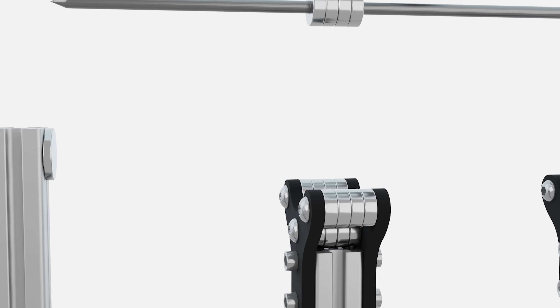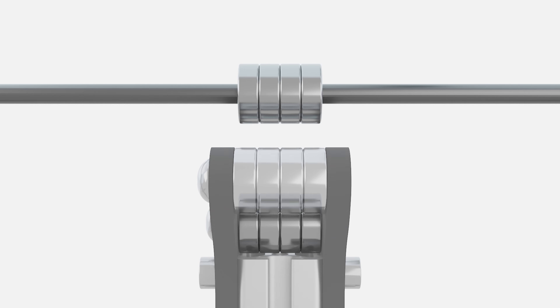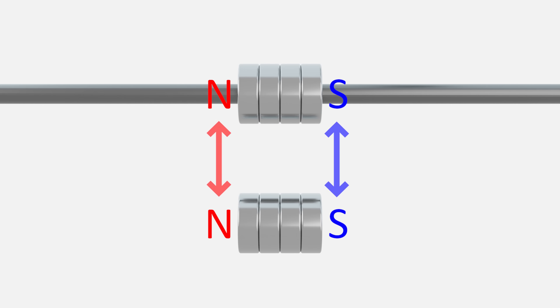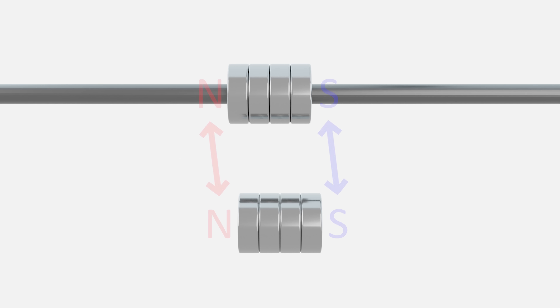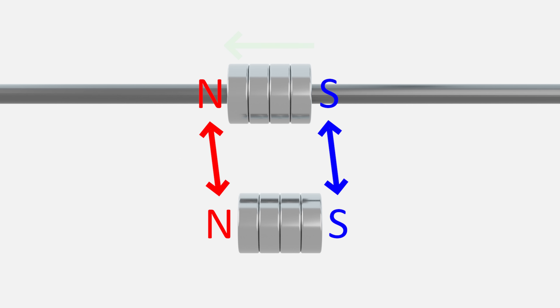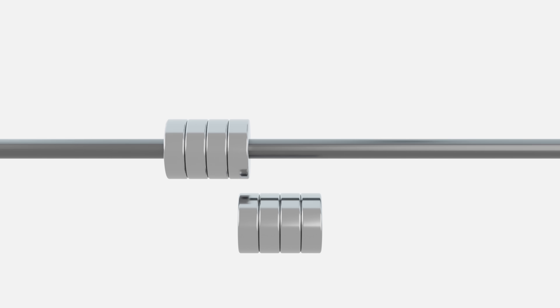For the magnets to levitate an axle, the magnets must be arranged with opposing poles, but if you've ever tried to levitate a magnet on top of another you'll know it's pretty much impossible to balance. That's because if the levitating magnet is offset by the smallest amount, not only do the repelling poles want to push it further to the left, but the opposing poles are now pulling each other together and will continue to do so until they both collide.